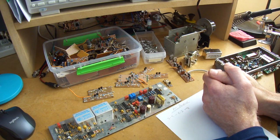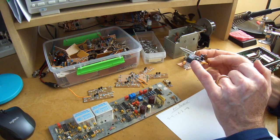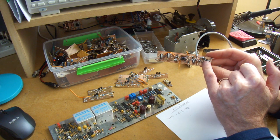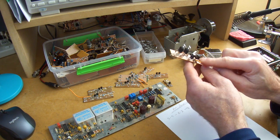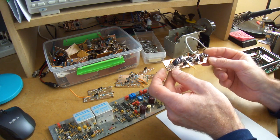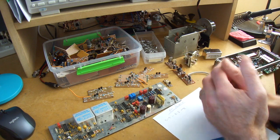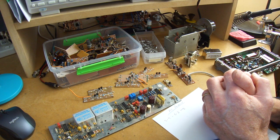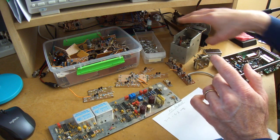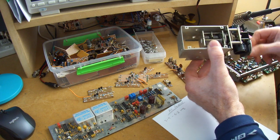Nothing novel, nothing too new. For the audio amplifier I might reuse an existing board with a push-pull output using a 3906 for the input stage, and probably a 5534 audio op-amp in the middle. I'll do some testing on that to see how it performs. It should be a good opportunity to have a play around making a nice stable VFO, and it'll be really nice to put these mechanical components to use.